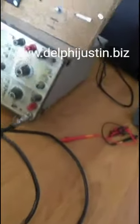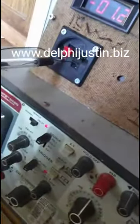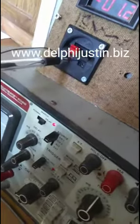Also, if you look inside this here, you can see the paperclip I soldered onto it. Then you see that black stuff? That black piece right there is electric tape surrounding the resistance. If it did push back in there, I didn't want the resistors to short out and bypass each other, so I put black electric tape around it. It was hard putting it in there with electric tape around it. It was hard doing it with these resistors. It probably would have been easier if I did it with a pin that had the tip removed off of it, but I don't know.